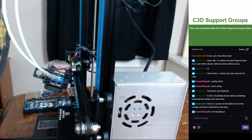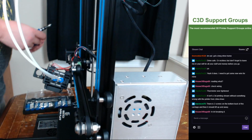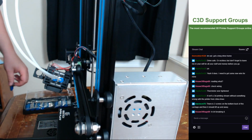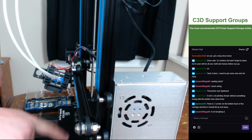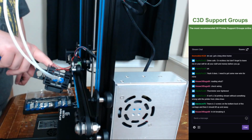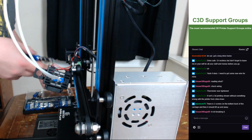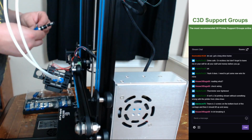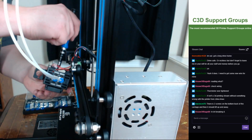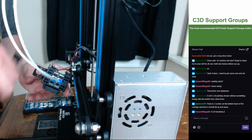Alright. So my only question would be, if it's showing a higher temp on the bed and the hot end at the same time, would that still be this thermistor being tightened too much? Because I mean, I can loosen it, but yeah, and if I'm being honest, it wasn't tight.